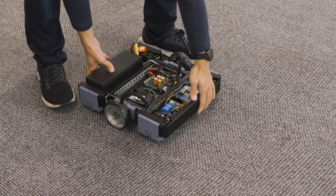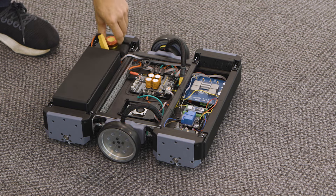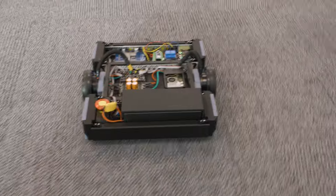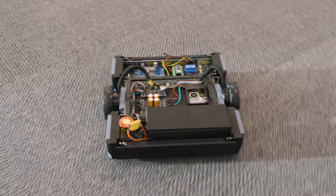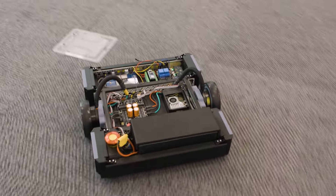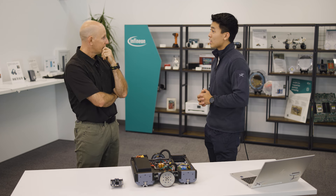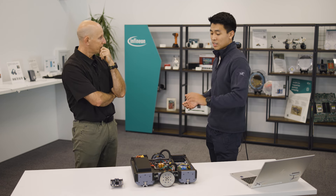With the PSoC C3, we're trying to have all the tools at the hands of developers, ready to use — that includes all the libraries ready to download and pull from the toolbox, with everything easily configurable. That covers everything from your communications interface all the way to the slew rate of the gate drivers, with our 6EDL7151 gate drivers that are SPI configurable. Everything is there at the tip of your fingers.